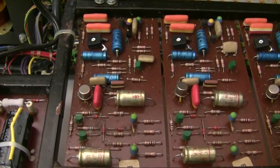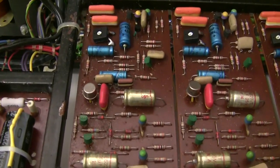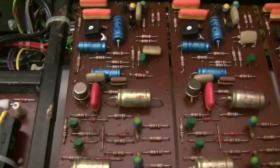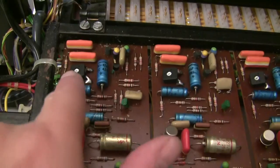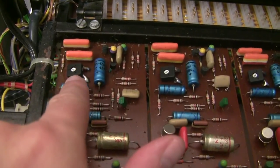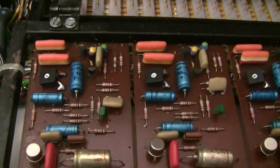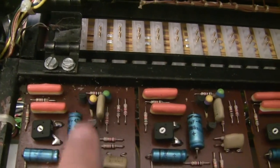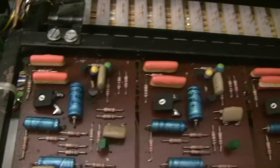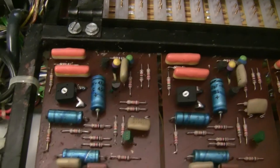So I took a look with the oscilloscope at this modulator board, which had a noise problem, and I followed the input signal past the delay, and I also reversed from the output, saw it was present on the volume pot, so that pretty much left these two transistors, which were used in the low-pass filter, and I found this one right here was responsible for the noise.